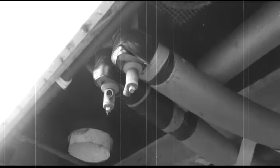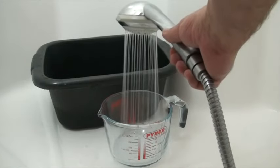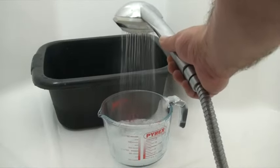Now that we're in the shower, this is where Flow really proves its worth, because by law there are non-return valves fitted in the shower. This means that water can come out in the direction it was intended but it can't be pushed back in reverse. The old antiquated method of pushing water back down through the system and out of the drain cocks underneath simply can't be used here. An engineer will probably remove the shower mixer block and leave it on the floor of the shower until spring — obviously meaning the water system and the property will be rendered useless for half of the year. But with Flow, it will push the water out of the shower head following the natural direction of the water until there's nothing left but air, and because there's no dismantling you're free to enjoy your property throughout the winter months.